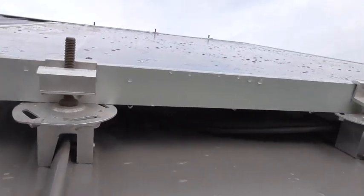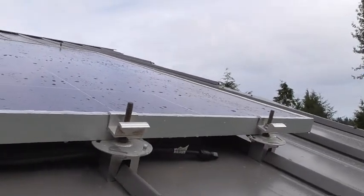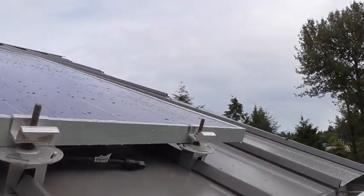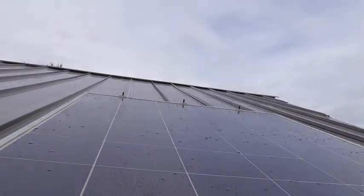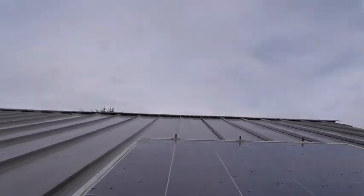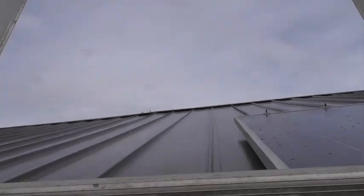What I do is I use three mounts per panel. These panels are four feet wide and they fit on three ribs of the roof. I've got three on the bottom and three on the top, and I'm going to mount the second string of solar panels above — three along here and then three up above it, two strings, giving me just over 1.4 kilowatts of power.